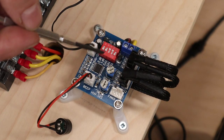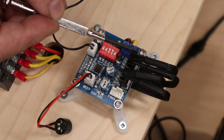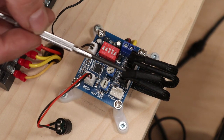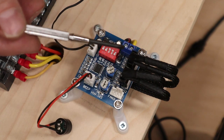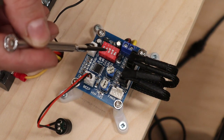Now on this fan board, I've got 2 separate Y splitters so that I can take that pulse width modulation signal and send it to the 2 front fans, and this one is going to the 2 back fans. Now depending on which plug you use, fan 1, fan 2, fan 3, you can have different functionality, and it kind of ties into these little toggle switches on this red block. So let me switch up the angle and I'll show you that.